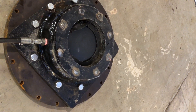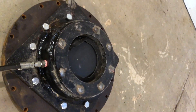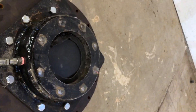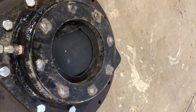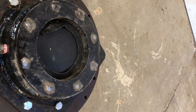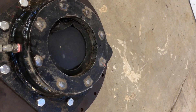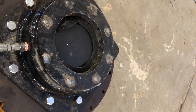Here is the very first pressure test. We're sitting at over 1,000 feet of depth. Zooming in on the gauge — 450 PSI. So we're talking fresh water here, of course. You can see that the rubber gasket is extruding out of the pressure chamber, so I'm going to have to stop here and regroup on that. Maybe I'll have to machine an O-ring groove into there. Never had this problem before. But anyway, so far we're well beyond the rating for the window — so far, so good.